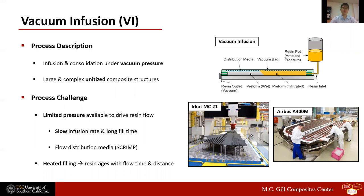To mitigate this issue, resin is often heated during filling, although doing so can increase resin degree of cure and viscosity with flow time and distance. Even for SCRIMP, the problem of evolving resin viscosity can persist, particularly as part size increases.